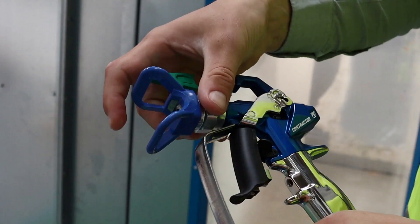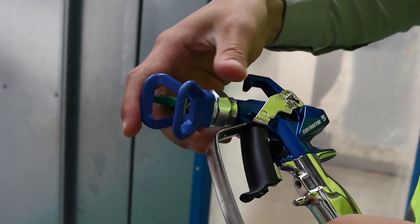To completely stop overspray and have all of the paint leave the gun and stick to the desired surface is impossible, but there are quite a few ways to reduce the quantity of overspray. Most of the time you can reduce overspray by tweaking the setup of the spray equipment — from adjusting the fan pattern to lowering the pressure and changing the spray tips.